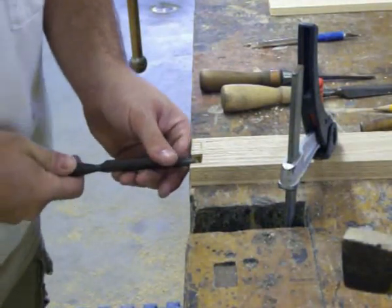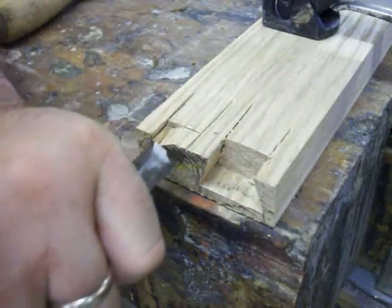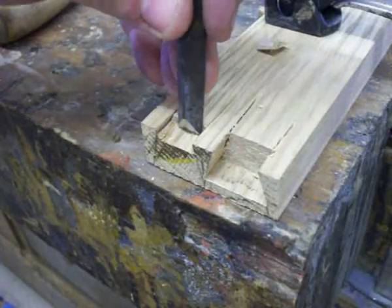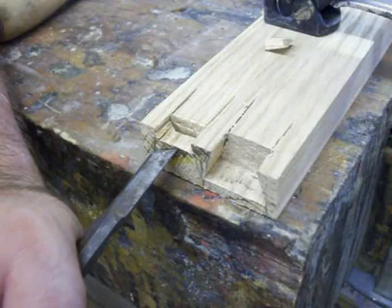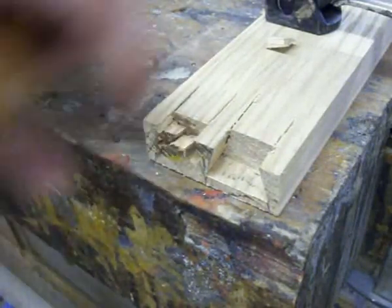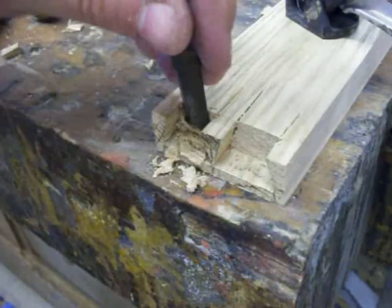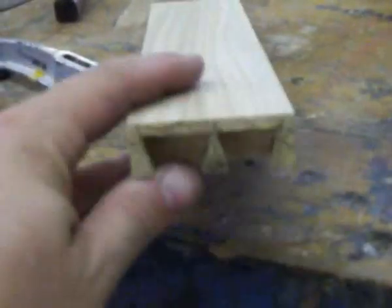Now I just chisel in where that scribe line is on the front edge. You can see I'm just taking off the top at an angle and then coming in on the flat to remove the middle waste — that's the safest way to do this. Just keep doing it a little bit at a time, put it right back to where you started your initial pounding cut, then come in and take your waste cut. I'm staying away from the scribe line completely until I get most of this waste out. Now I'll go right up to that scribe line and chop, but stay just in front of it because the bevel of the chisel will push it back slightly. If you pound in right on the scribe line you'll go too deep. Now there's what it should look like.